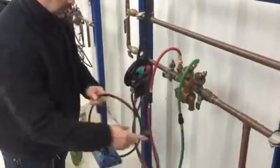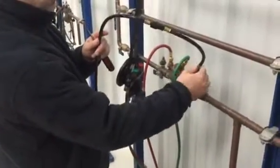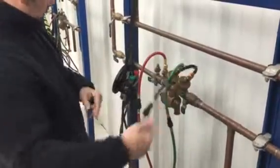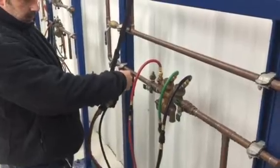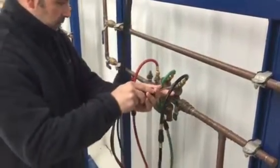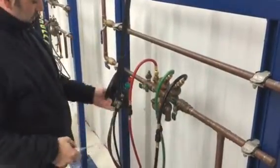You're going to convert that measured pressure into an applied pressure. You're going to put 8 pounds of back pressure on that check valve. So open up the high control, very good, and then open up test cock 4. Now your back pressure in that second check.